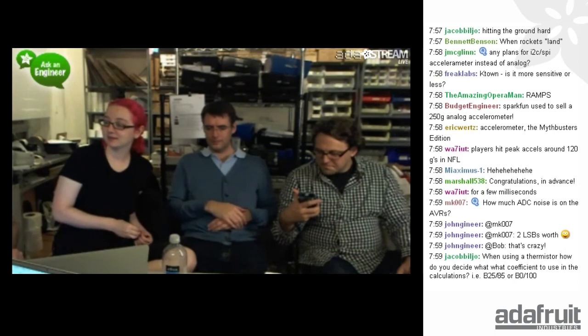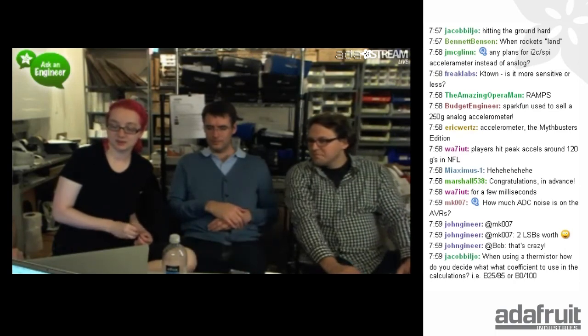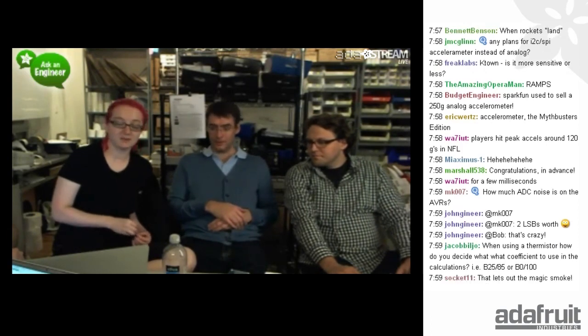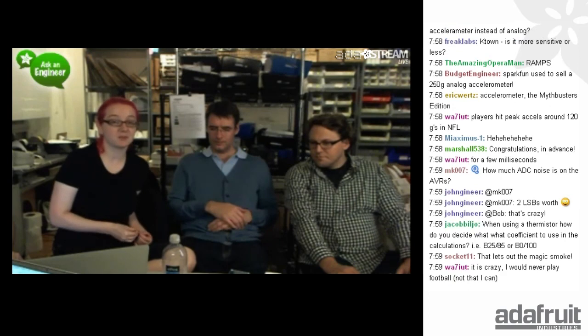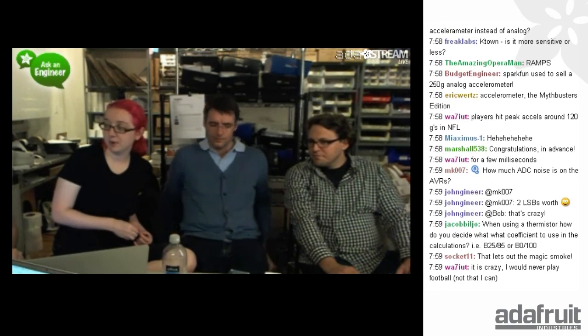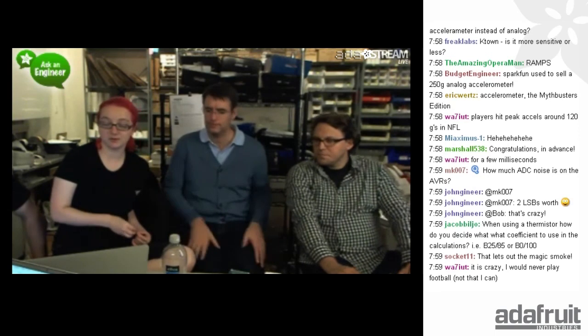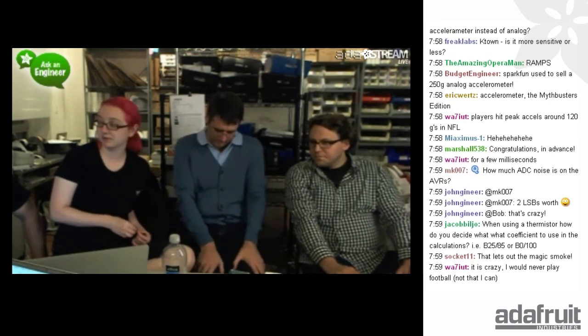All right, we're going to do one more question, and we're going to run a couple minutes over, but we're going to just go for it. How much ADC noise is on the AVRs? There's some really good tutorials about that. It depends a lot on what you're doing, what your AREF is, whether you're running other stuff at the same time, what power mode you're in. We have posted a bunch of notes about it. I know also Open Music Labs did a tutorial about how to get your best ADC response out of the AVR.